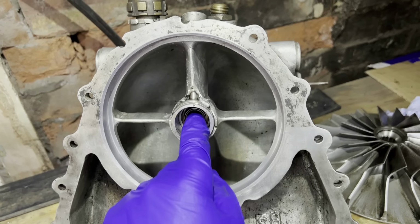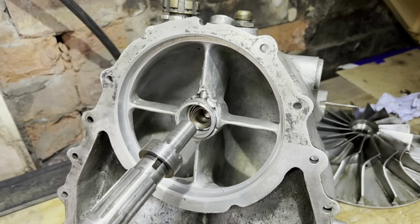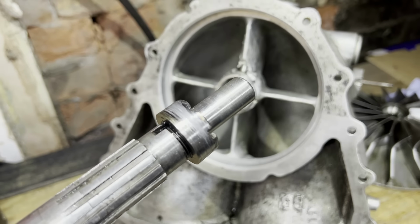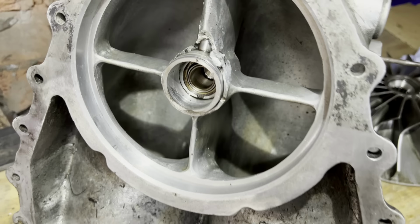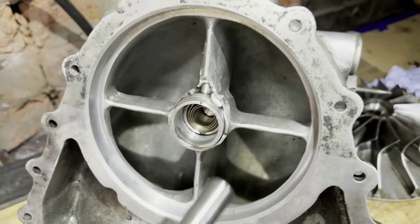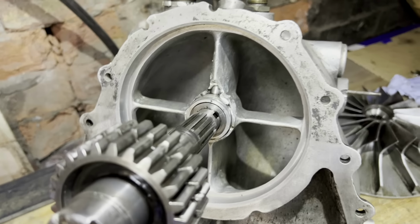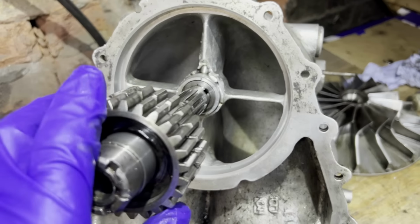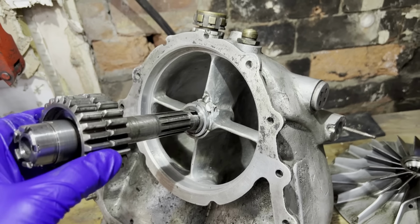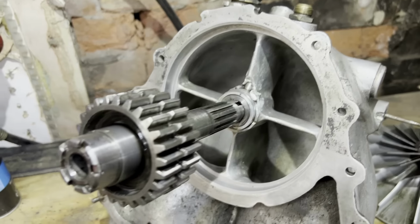And now I've got the supercharger shaft apart. This is the most interesting bit. You can actually see, although it was turning nice and smoothly when it was all assembled, and by the way, I fitted the supercharger retaining nut back onto the shaft, and you can see there, see that scoring where it's been touching inside here due to the wear in these bushes. And if I just bung this in, you can see there's also a fairly close clearance around that retaining nut. It's all intended to keep the oil back in that bearing and not into the airflow, but that's actually really loose. Loads of play in there. If I took the nut off, actually there'd probably be more play than that, and that was just allowing the shaft to lift up and down slightly.